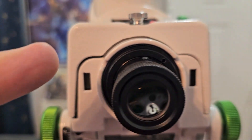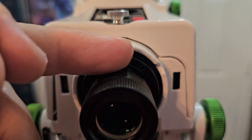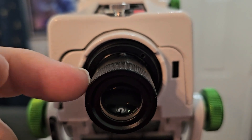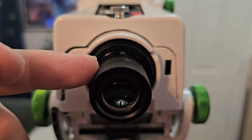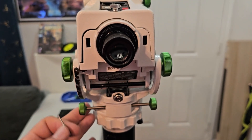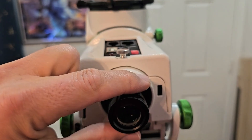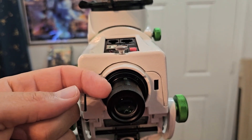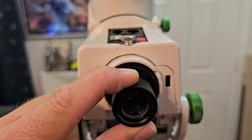On the inside, the reticle is in a little ring and those screws are what holds it in place. It's cone shaped to the back of the eyepiece. Because that cone piece is resting against the eyepiece, when we take the mount off and hold this straight up to the sky and turn it, it'll actually turn the reticle.